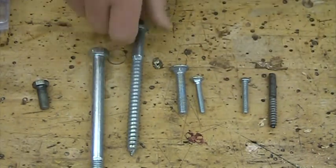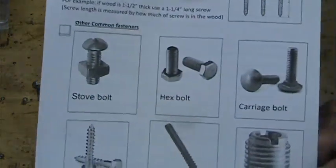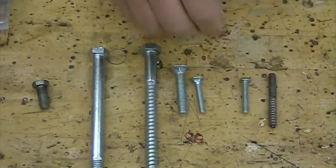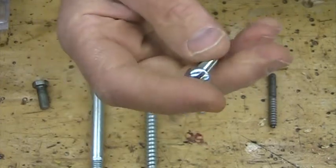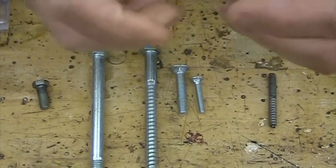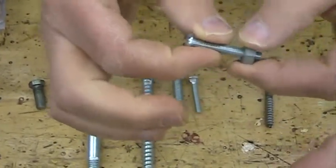They have different style heads and are used for different purposes. If you're looking at the handout that goes along with this fastener lesson, we have pictures of all the different bolts so you should be following along. The first one is called a stove bolt. A stove bolt looks like a round head wood screw — it has that round head with a slot on it, usually a straight slot but it can be Phillips. But it's a machine thread, not a wood thread, and it's designed to have a nut on it. If it's going into metal you would just put the nut on the bolt.